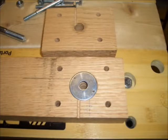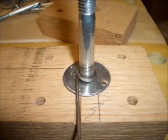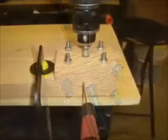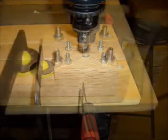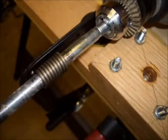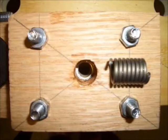I tested the jig with a 7-inch long, 3/8-inch diameter bolt. Here you can see that I've got the bolt installed with the kanthal wire started around it. This is a view of the completed jig with the wire inserted. This shows the jig clamped to the table with an electric drill attached to it. For the test, I used about 1 foot of kanthal wire. After turning the drill on, I ended up with a nice tight coil. This coil is about 1 inch long, and this is pretty much what I'm hoping to get with the entire 100-foot length of wire.